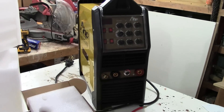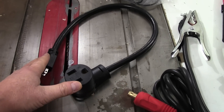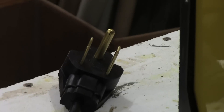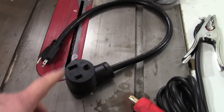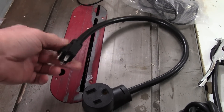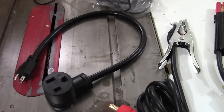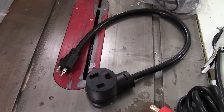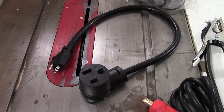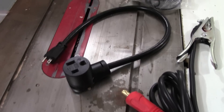This welder I paid $680 for. It's dual voltage — 110 and 220. The welder comes with a 220V three-prong plug. If you want to use it on 110V, a regular household outlet, you plug the machine into the included pigtail adapter. You will lose a little performance: on 110V, TIG drops down to about 150 amps max, and stick welding drops to about 145 amps max.